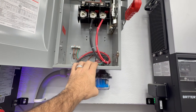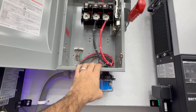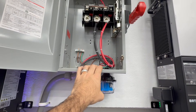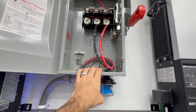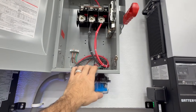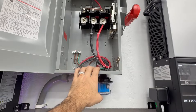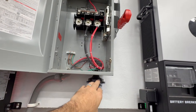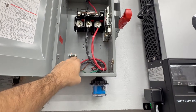That may happen if you have some sort of high voltage spike. I don't want to say a direct hit from lightning, because very few things can actually tolerate a direct hit. But this is made to send to ground any high voltage spike. It goes through the wire, hits the SPD, and if it's over 600 volts, it sends it to ground.